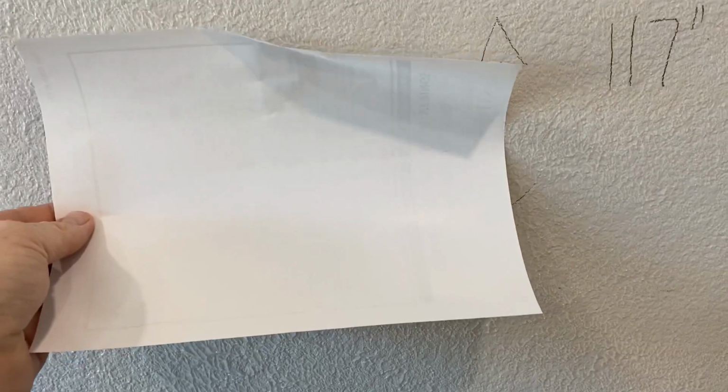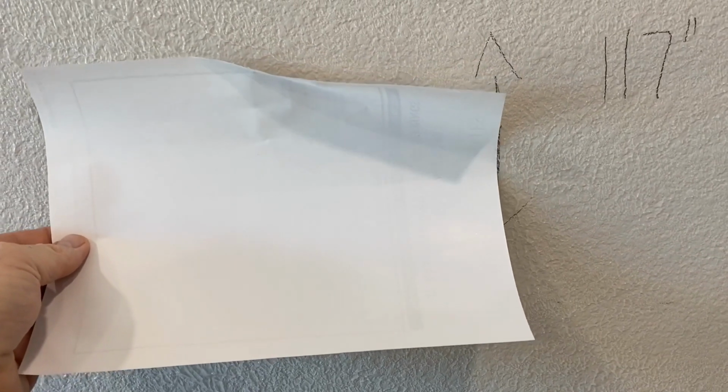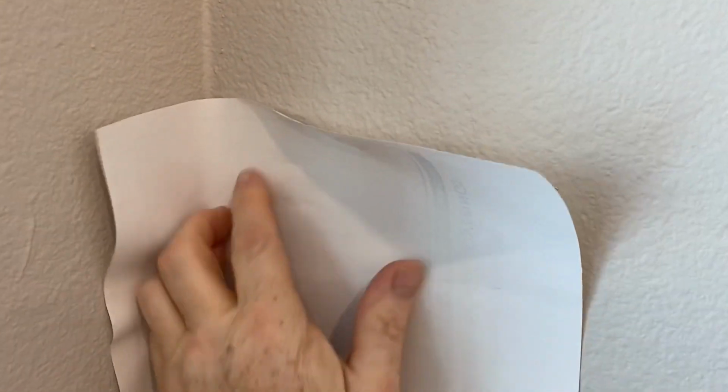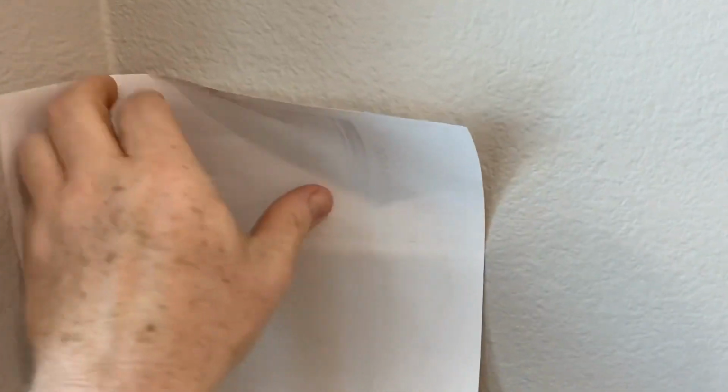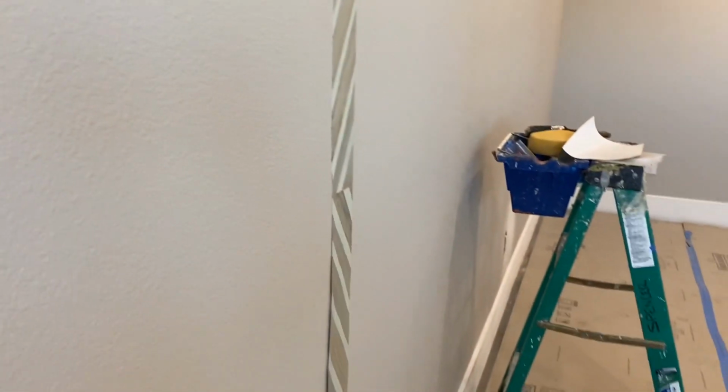When you choose either one, and you should work out both, you want to go like this with either a tape measure, simulating the width of your wall covering, or the wall covering itself, and you go like this, over to the edge, all the way, and you determine whether or not you achieve a better symmetry with either this much of your last sheet left, or you may wind up with something like this, which is what you don't want. So depending on where you start in the middle will determine how the end sheets look. In either case, you'll have symmetry.